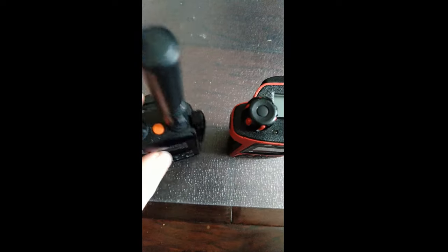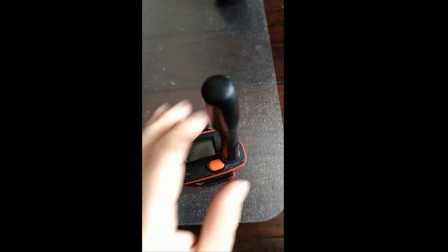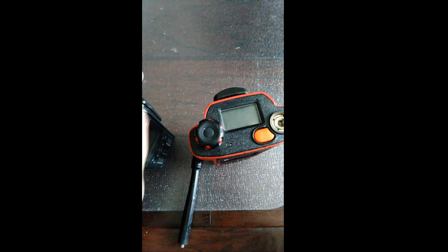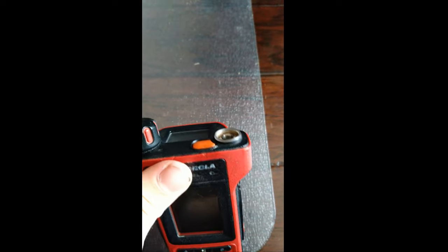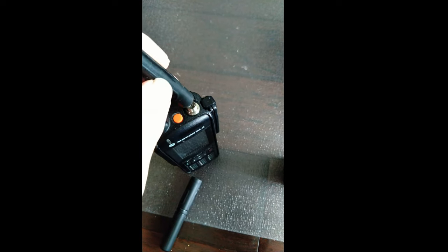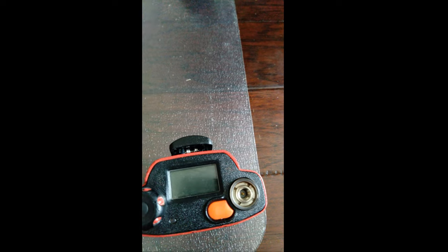Unlike the MTP 6000s where the light sensor is down here, on this one the light sensor is on the top, which makes a lot more sense. These are both dual-function click-turn rotaries. They both have normal SMA connectors. One difference to note: on the 6000s the antenna connector is recessed into the casing, whereas on this one it's not. So 6000 antennas have a little extra bit of plastic that goes over them, meaning you can't put a 6000 antenna on an 8000.